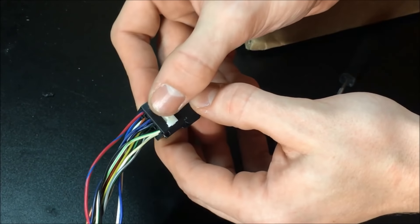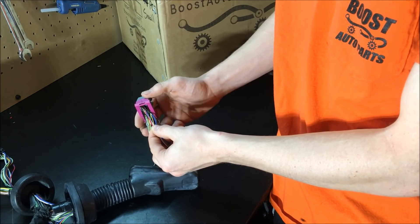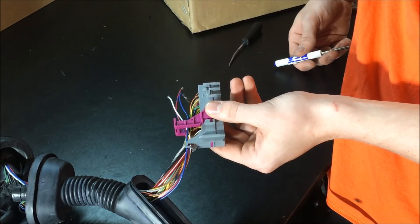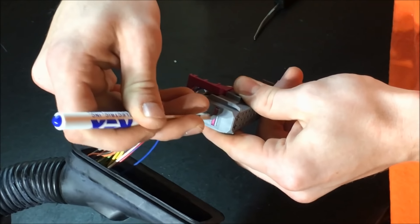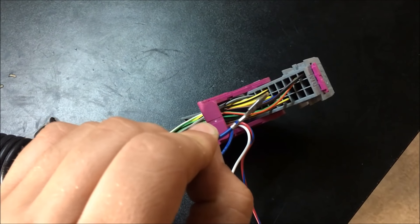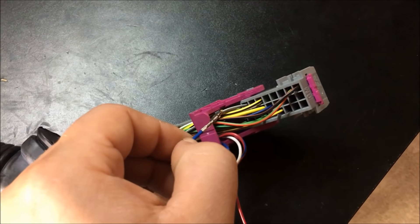Push down on the white lock to lock the pins into place. Slide the pink lock backwards slightly and feed the wires through it. To unlock the gray connector, get a small flat head screwdriver and push on the pink tab — you'll hear it snap and it will be unlocked. When entering wires into the gray connector, the crimp on this side is always going to face towards the pink connector.